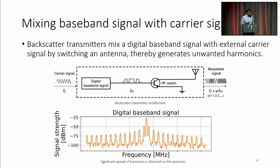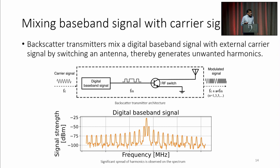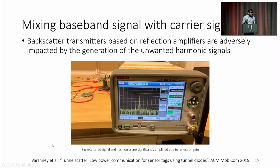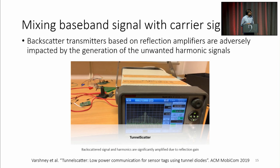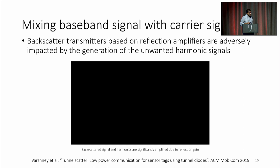You can see here a lot of harmonics. The first piece you'll see is basically a standard backscatter, and the next one uses a tunnel diode oscillator, and you can see there's a lot of spectral noise there. The way we can get past this is by modulating the signal, mixing it with a signal that doesn't have so many harmonics. Instead of a digital signal, we'll mix it with an analog signal. As you can see in the pictures, the result is the harmonics essentially go away.